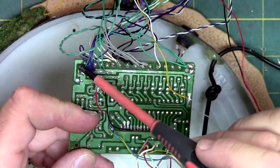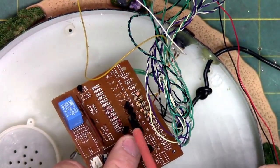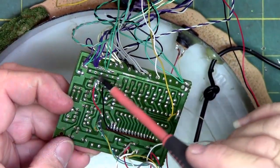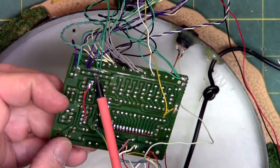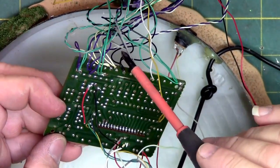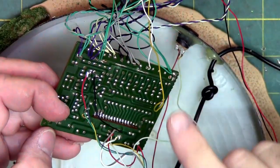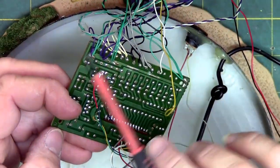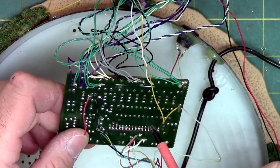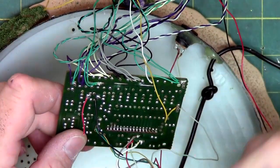These are all your light wires. This is the yellow and white from the top — the white wire goes to that transistor, which does your dome. Your ground runs over here on the negative track. You have a bundle of greens and purples, another bundle of purples, another set of greens, sets of whites, blacks, and grays. There are so many lighting paths for different pulsing patterns — about five or six paths complete. That's a lot of lighting circuit work.